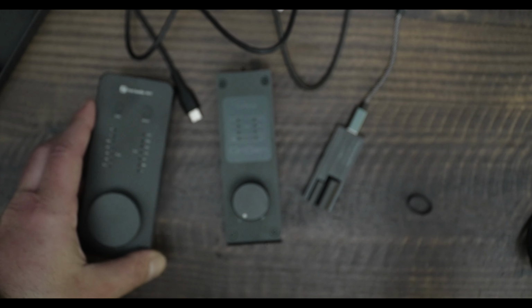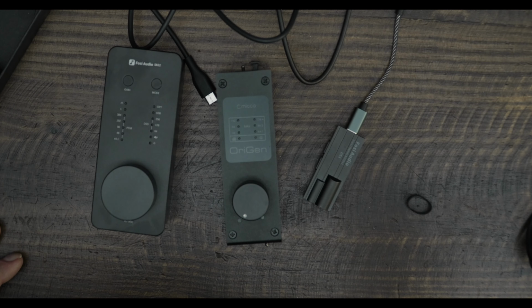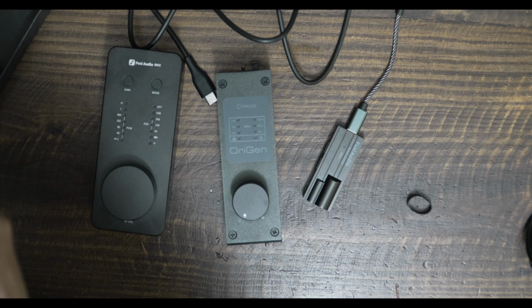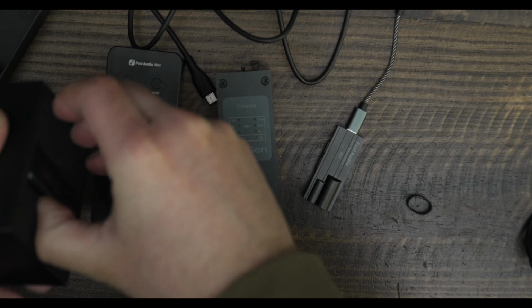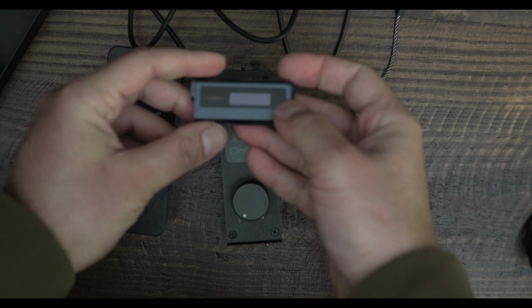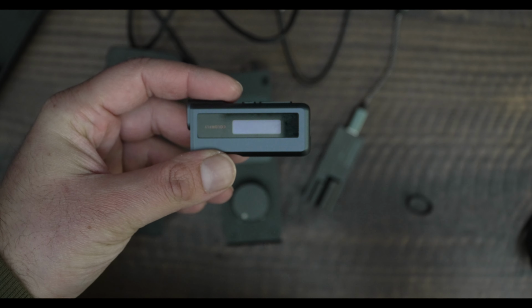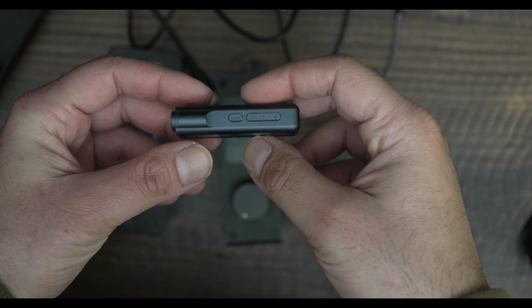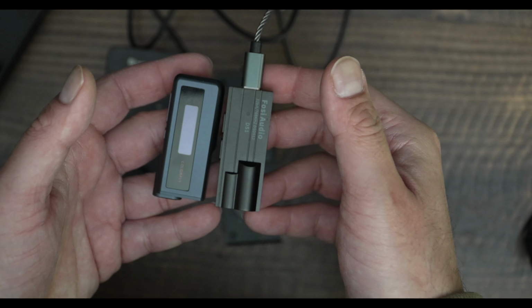Finally, let's quickly discuss Phase 3, where I used various headphones and IEMs to determine if the Fosi gear had difficulty driving them. Generally, no. Both the DS1 and SK2 had no problems at all powering any dynamic driver headphone or planar IEM. Even the 600 ohm Beyerdynamic T1 2nd Gen got plenty loud and seemed to perform as well on the Fosi products as on my desktop units. The 600 ohm DT880, however, did not fare well, but that headphone needs high output impedance of about 100 ohms, as I discussed at length in a series of videos a few years ago.